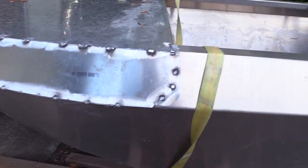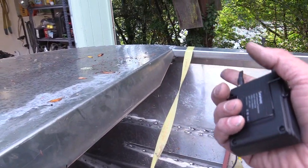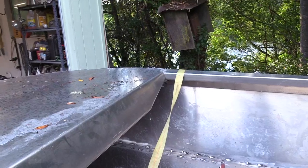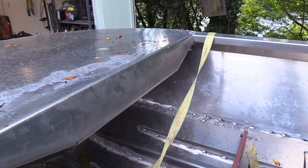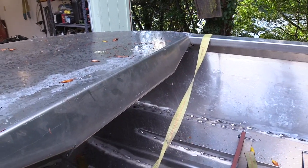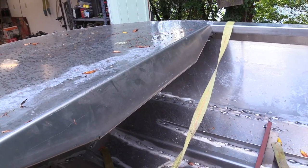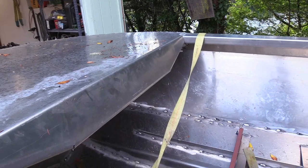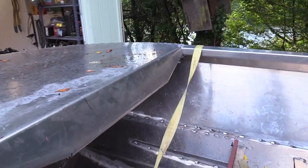So, I don't know. It's going to be a twisted whole boat. That's what I'm going to be stuck with. I'm probably going to end up trying to jack that up somehow, at least get that even over there in the corner. Possibly try and pop that up and put some sort of an I-beam across there, but you got all your steering stuff to put in. You got a bunch of stuff that's got to go underneath that dash. And somehow I got to figure out a way to put something on end straight in there, whether it's I-beam or just some flat stock on end. Maybe 2-inch wide by 3/8. It's got to be pretty heavy duty to hold the weight.